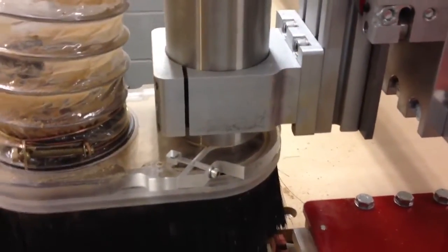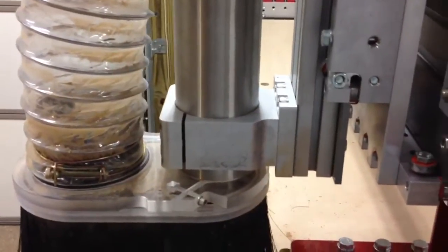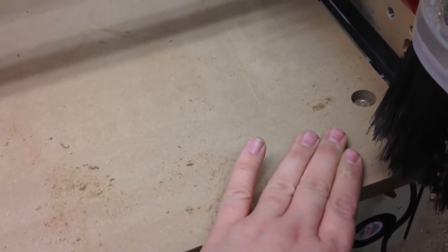Other than that, I think it went pretty well. I know I need to buy a precision shim kit from McMaster or somewhere to get the final touches, but it cuts well — it cuts fine. This router can certainly handle these big diameter bits. I think I took off about 30 thousandths of an inch on the table. I need to make one more pass yet to get rid of the area I milled into the table earlier. That corner of the table was the lowest point, which is where I zeroed everything off of, so I ended up taking a little more down than I wanted to, but that's alright — there's still plenty of room to get down to a smooth, continuous surface.